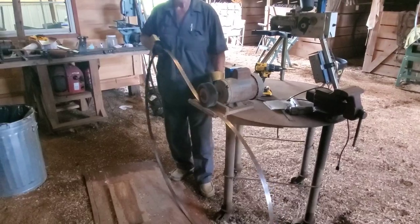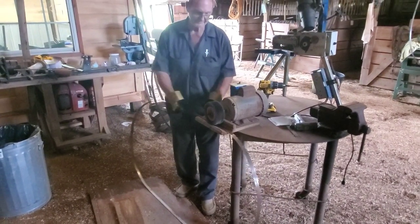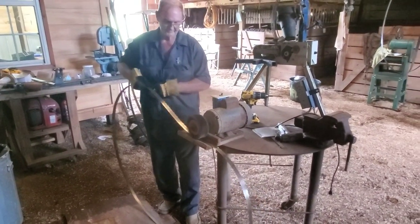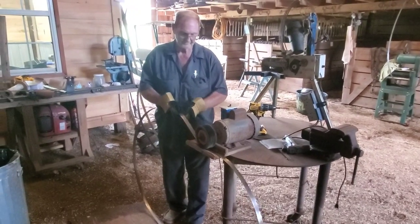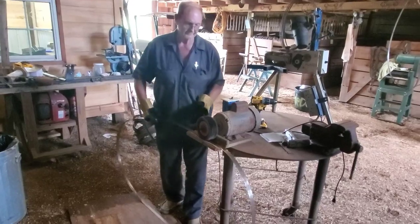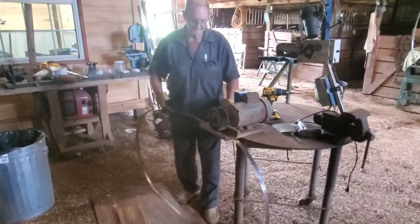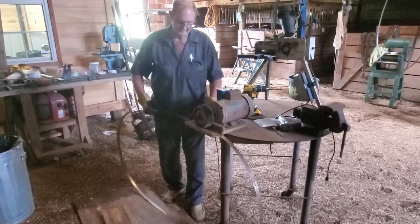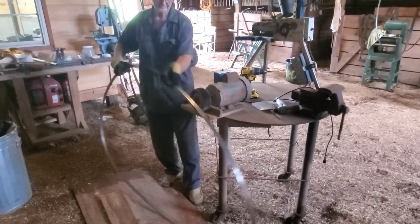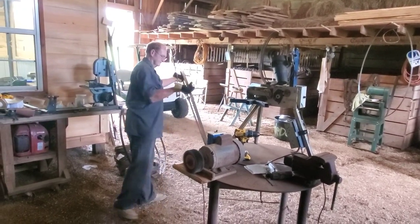You can see the rust coming off — this is one way he cleans a blade. This gets rid of any burrs, anything hanging on there, the rust. He also soaks the blades for a short period in vinegar to help break that rust off. While he's sharpening, we'll show you something new he added to his sharpener that will make these blades rust-resistant — rust prevention added to them. He does one side and then inverts the blade, just flips it around.